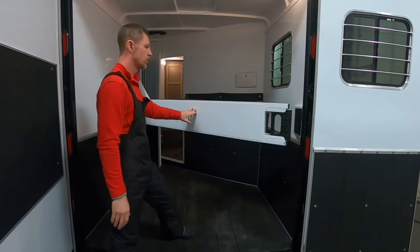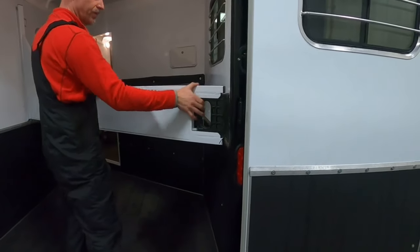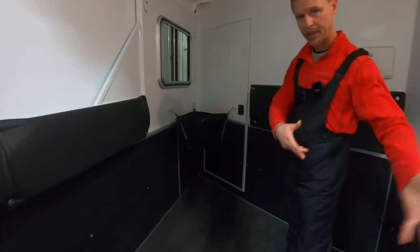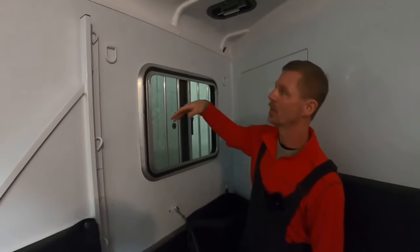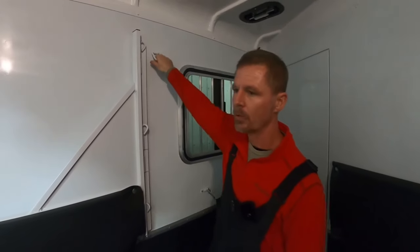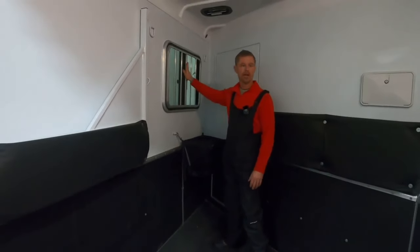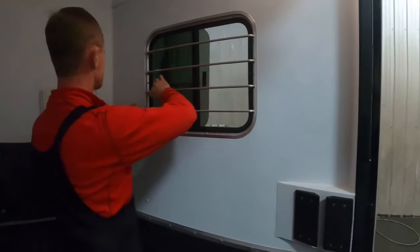This is spring-loaded, so when you unlatch with the one-hand paddle latch, these are all rubber — we don't get any vibration off of that — and it will swing around and stay against the wall. From here, it's very easy to bring a horse in and tie off the head. I like these lay-flat tie rings; we don't have to worry about eye injuries. These things are welded directly to the galvalite — I've seen some in the past that were bolted on, and a horse can actually break those bolts out. Drop-down window is standard; I'll show how it operates from outside. And of course, a sliding window on the butt side with a screen.